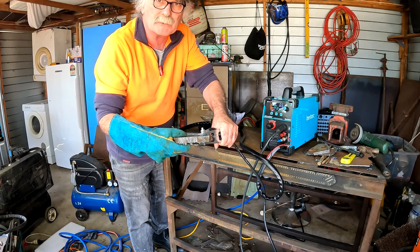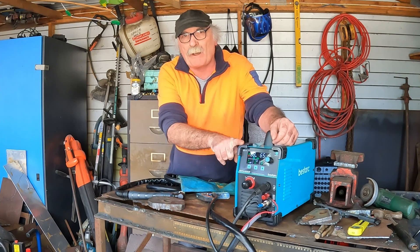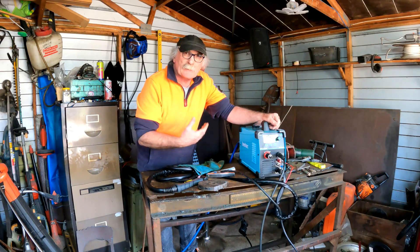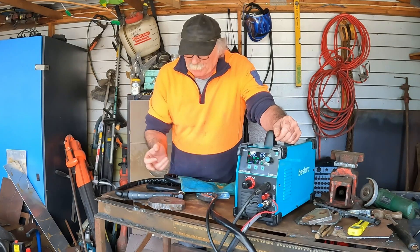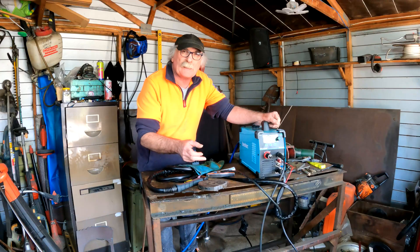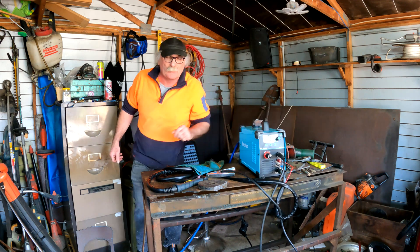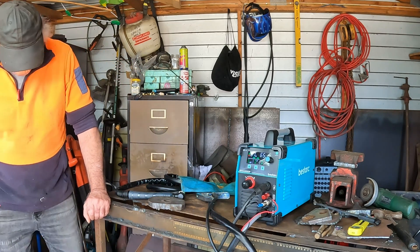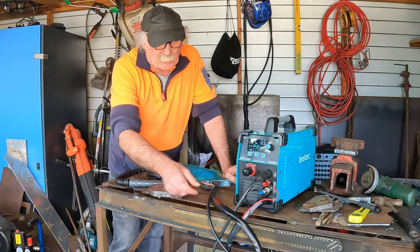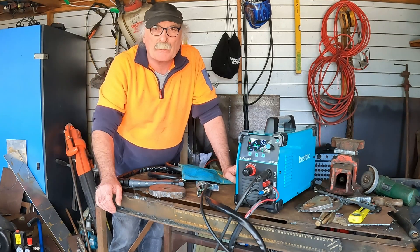20 millimetres on a 65 amp single phase plasma cutter — personally I think that's really, really good. I mean, you're still only talking about workshop tools, and if you can cut that sort of thickness — now there's no way you're going to be cutting that all day. I've got something on fire down there — holy shit, hold on! Remember what I said to you — don't leave your cord hanging down there. That's just what I bloody did and burned another hole in another cord.